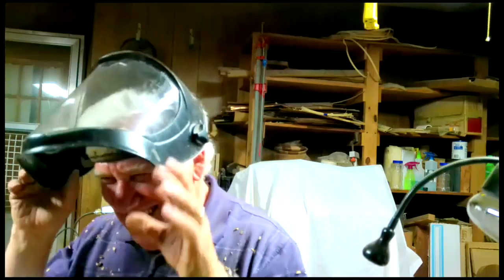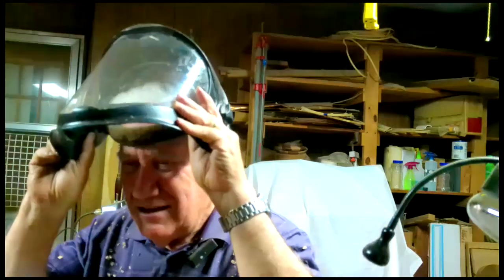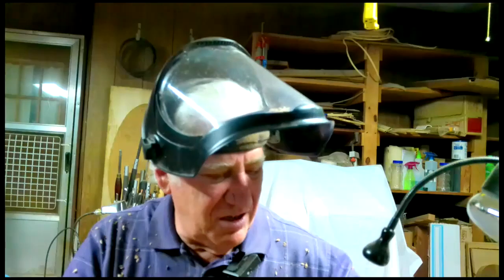Thank you. I have a quick question. When you put that stub center in your chuck, is that a special kind of stub center, or is that just your regular Morse taper one? I use a Morse taper. You can do a Morse taper one the same way. It doesn't hurt the taper. My Morse taper's got a shoulder on it, the jaws will grab the shoulder. Right. Most of them have a taper shoulder. The shoulder will help you square it up.